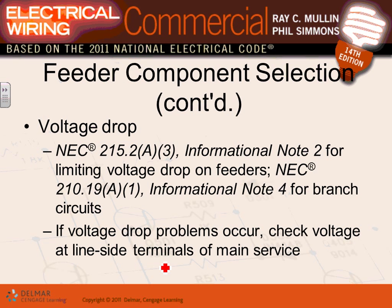So why? Because it's highly unlikely, Adam, if you go look at lighting panels and receptacle panels, guys, that they go higher than 225 amp. Anybody know why? If you wanted a 1,000 amp lighting panel, you know what that would feed? The lighting system at Dunwoody here, and 10 buildings like Dunwoody. So it's a lot of amps to have one lighting panel at 1,000 amp.